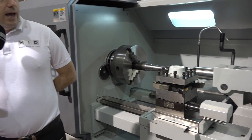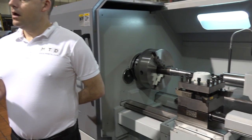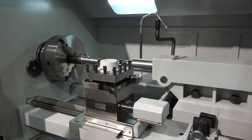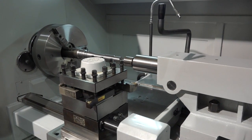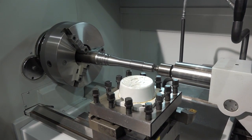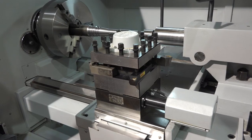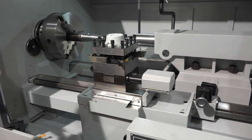Now this is quite a big machine. How does it compare to other models and brands on the market — do you take the weight and stability as a big benefit? Yes, we've looked very closely at the capability of the machine in terms of its strength, width of bed, and other aspects. It's got a D111 spindle nose and a three range gearbox so it's a powerful machine. This has got 630mm swing and a 2m between centres. We can get a 3m or 1m version depending on requirements. The 2m is the most popular for stock, and with the GSK control it's priced around £40,000 — a very attractive package.